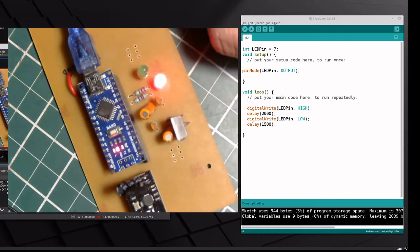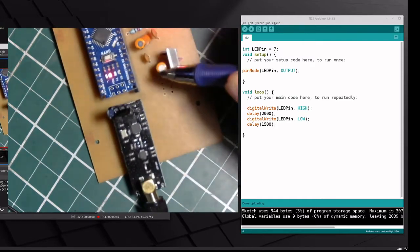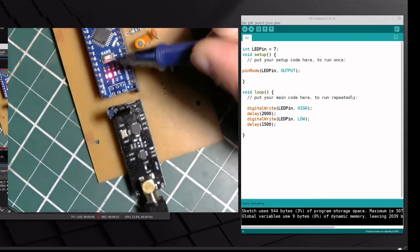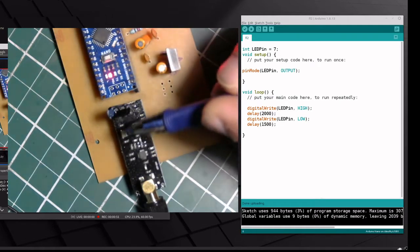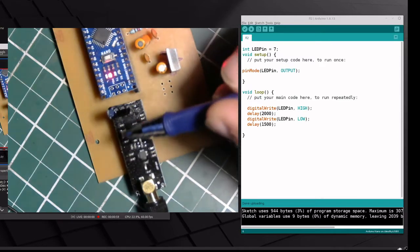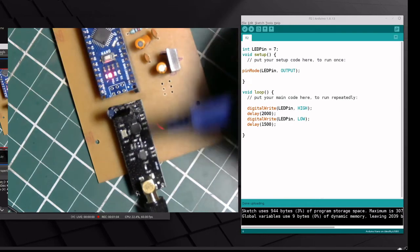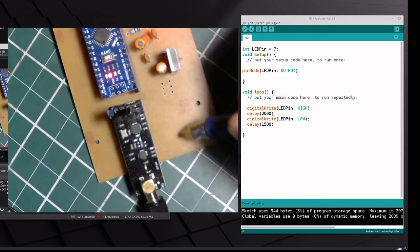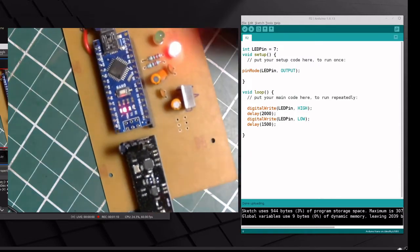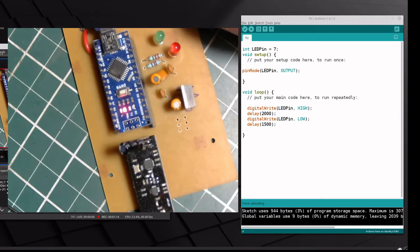It's a radio communication device. If you look over here, you'll see an NRF24L01 radio connected to the Arduino. The NRF radio doesn't have any light indicators on it, so there's no way to tell if you're receiving a signal or getting a radio acknowledgement from the other radio. So I decided to add a couple of LEDs to the circuit to visually inspect whether transmission and reception is going on properly.